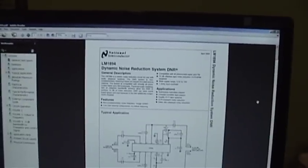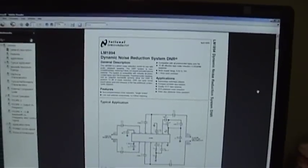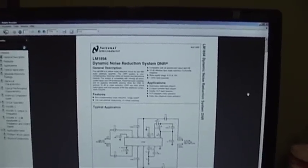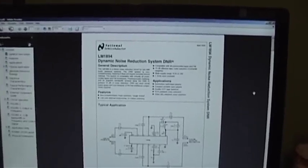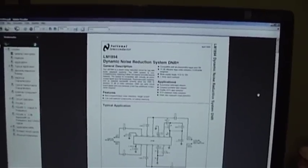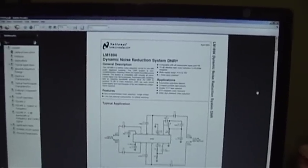But when the music is playing and there's lots of instruments going on, or there's lots of high-frequency instruments playing, the low-pass filtering technique becomes unsuitable because it's going to distort and destroy the music, and you'll hear what it's doing. Well, the idea behind psychoacoustic masking is very simple. The theory is that when a more desired tone or sound is being played, you tend not to notice lesser intensity and potentially undesired sounds, such as quiet tape hiss.